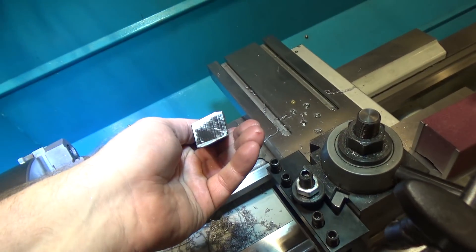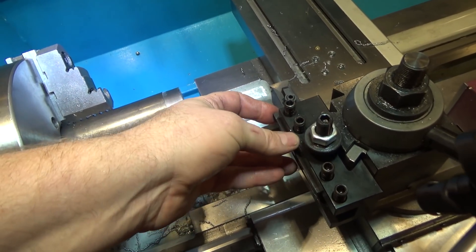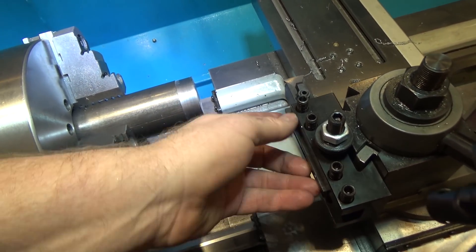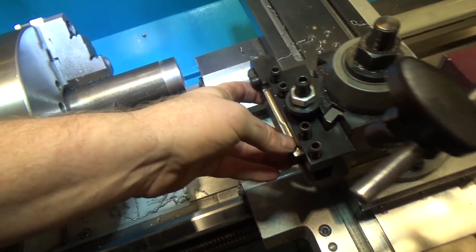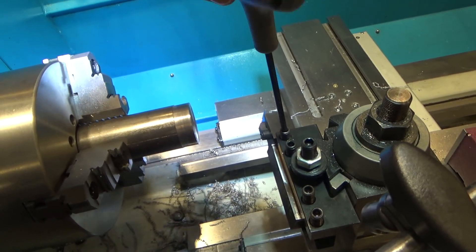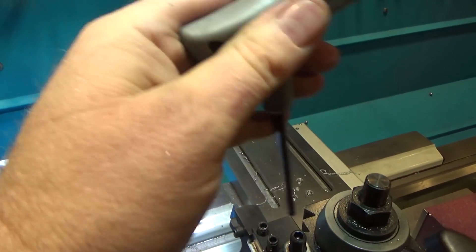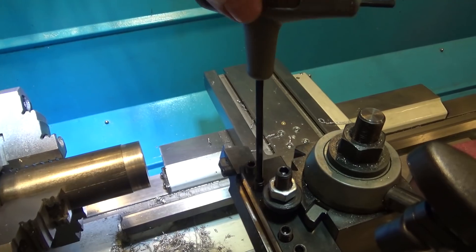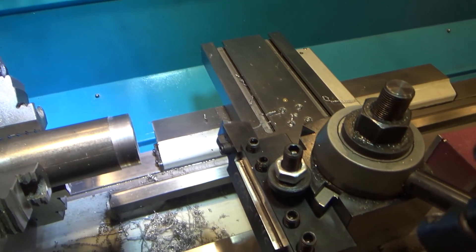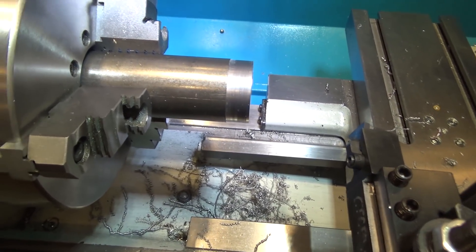Here's the cutter — there's the parallelogram I've taken out of it. You can see it still works as a regular cutter when tightened down. The flats are parallel on both sides, so I can tighten that in place. Now with the parallelogram cut, I can also put it in at the 15 degree angle, which is what I set. I used an offset tool holder because I found a deal on one — I'm not even sure this is going to work since I haven't tested it yet. Let's see how it works in the real world.